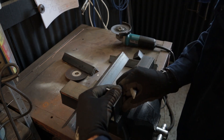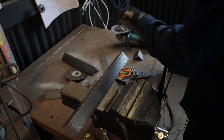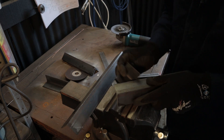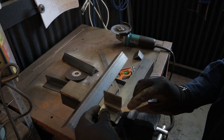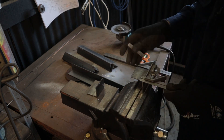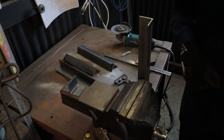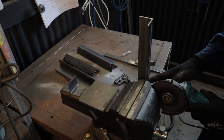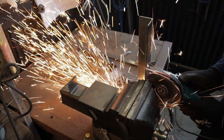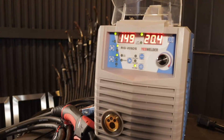I like to have all components cut, cleaned, and prepped before I begin fabricating. This is only possible if your design has a lot of thought put into the sequence of construction — which is why CAD design projects are helpful. If you have a hard time visualizing a finished product, FreeCAD gives you the ability to see the components come together in the virtual world so you can identify problems before you even touch a piece of metal.